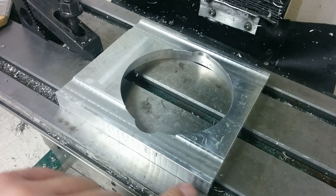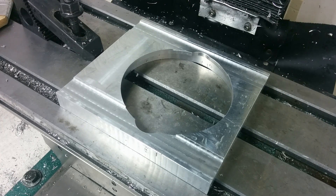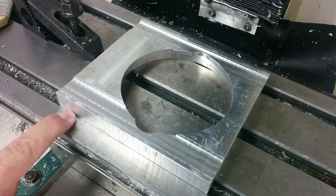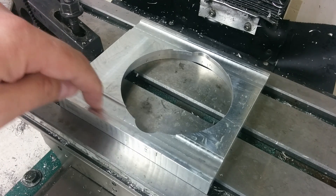I've been setting this up by sighting across the T-nut slot to get it parallel, and that seems to work really well. Then I just zero off this face and this face. I know I could build a fancy fixture or put some stops on the table to locate it perfectly every time, but I don't want to build a fixture or clamps or stops — I don't have any. So I'm just doing it this way and trying to get over my fear of screwing up a part by having to unclamp and reclamp it. With the 7/32" I'm going to re-machine the standoff slots because thanks to a bad config file they're in the wrong place.